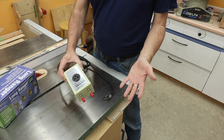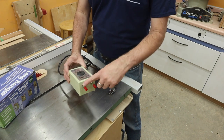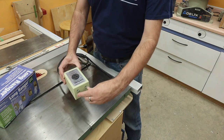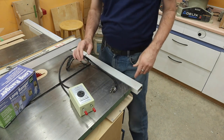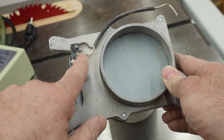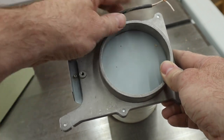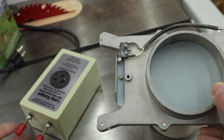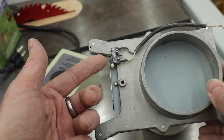There are all kinds of remote control systems for dust collectors. The main difference with this one is that it's not wireless — it's got these little terminals here. You run wires along, and when these wires make a connection the relay trips over and the dust collector kicks in. The idea is that you're supposed to have these little micro switches on your blast gates. The kit comes with one and you can buy more, and when you open your blast gate the switch triggers, turns the dust collector on. You close the blast gate, the dust collector turns off.